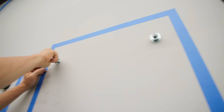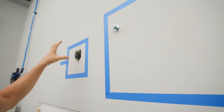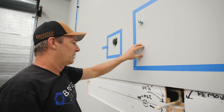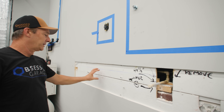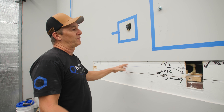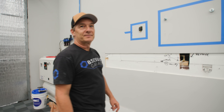Now what I have to do is cut a hole here for power. I'm going to move the 30-amp 240-volt circuit here. And I'm going to move the water over here. I'm going to put a bucket filler at 48 inches right here and that'll pretty much be it. Then I'll fix all the drywall and get everything mounted. So that's the update — piece of cake.